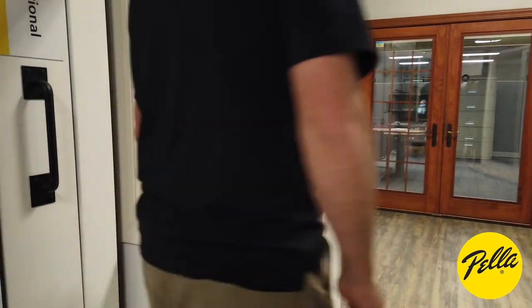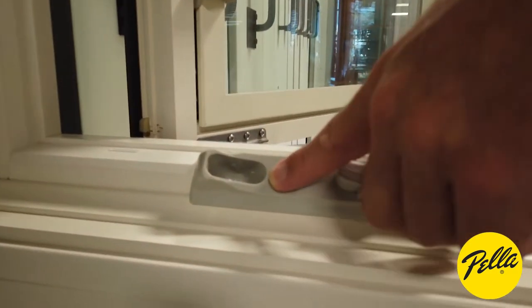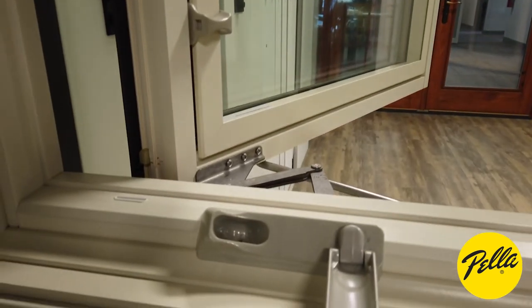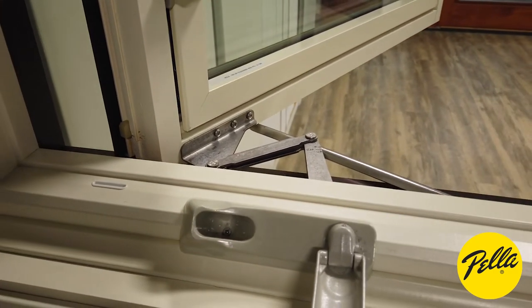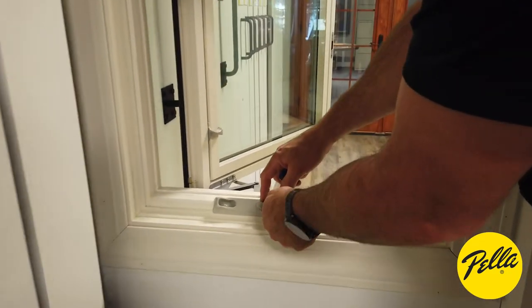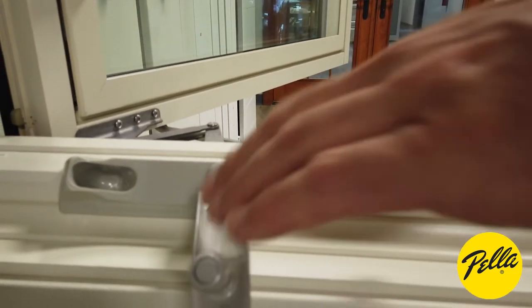You can see inside of here there's a screw. If you have an older style casement, you won't have a screw in there — there are two little plastic tabs that'll lock down. For the newer style casements, you'll see a screw, and it's just a number one Phillips bit. There's also a screw in your crank handle here — that's a set screw that you'll have to take out.